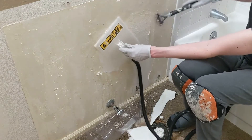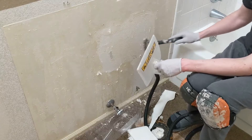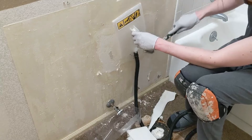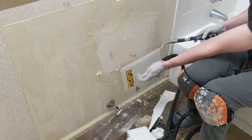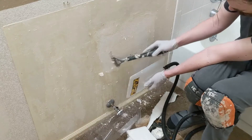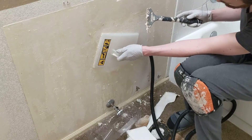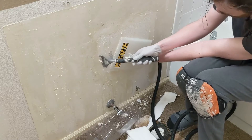I'll just go back over those areas. You can see we've still got some paper on there. What we're going to do next is actually sand the walls and get all this nasty stuff off, before we treat them to lock in whatever residue might be left. You see there's a paper backing behind it — we got the wallpaper itself, and now this backing is going to come loose here.